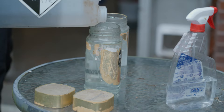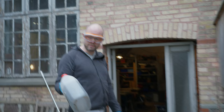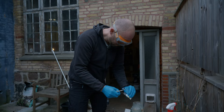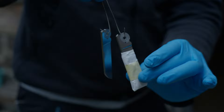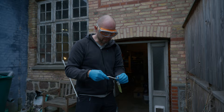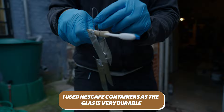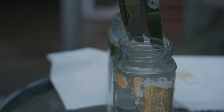If you're not careful here you will have a very violent reaction between water and acid. Always: acid into water, never water into acid. If you pour water into acid it will explode in your face. The blades are cleaned — no fingerprints — and I'm hanging them from a titanium wire because the acid won't react with titanium. I'm placing the blades so they don't touch each other, then sinking them into the acid and leaving them there for five minutes.